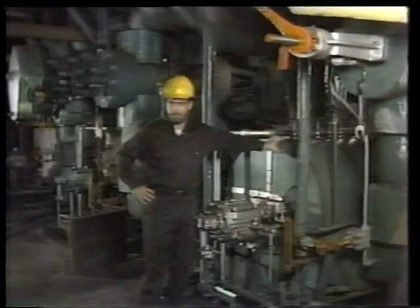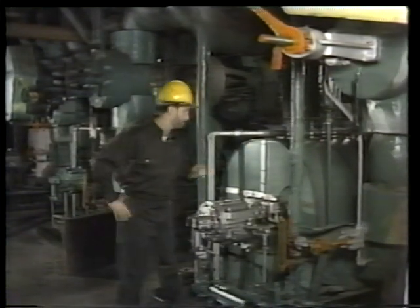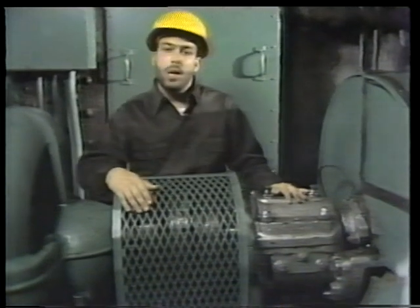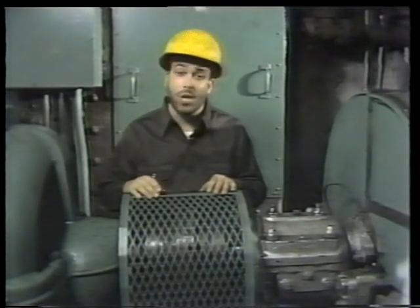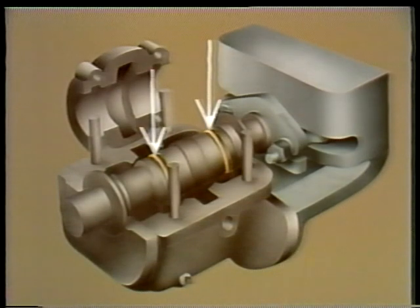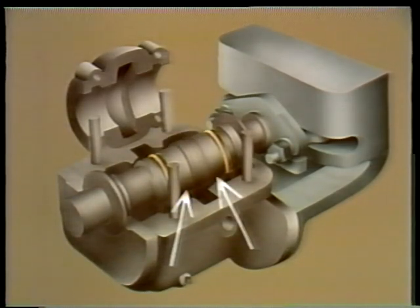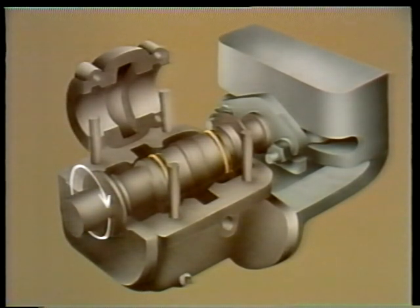This is a boiler feed water pump — a multi-stage centrifugal type with two bearings. The first one is a journal bearing. It supports the weight of the shaft and handles the radial loads caused by the shaft's rotation. When the housing is removed, you'll see a two-part bearing shell, two oil rings, and four bearing inserts. Two fit into the top shell and two fit into the bottom. These soft Babbitt inserts actually bear the load. The oil rings turn on the shaft as it rotates, bringing oil from the reservoir up to the top of the bearing to provide a film between the bearing inserts and the shaft.